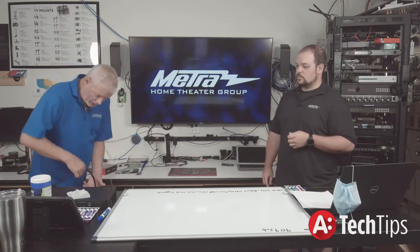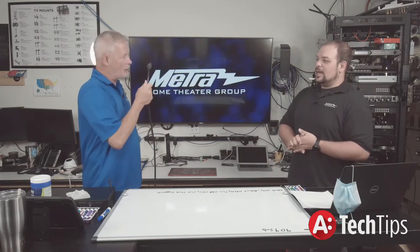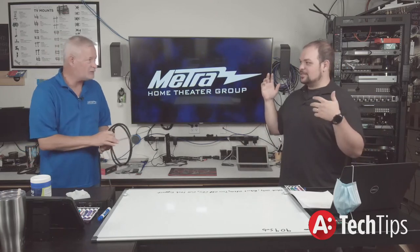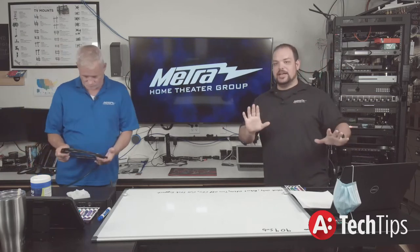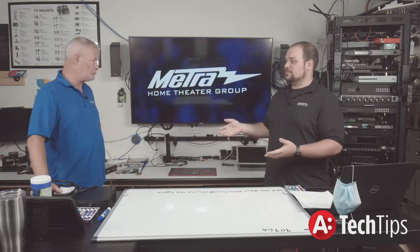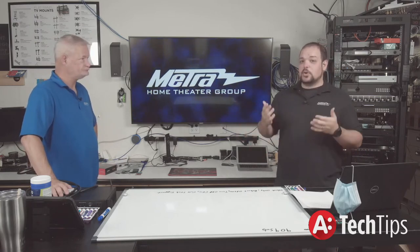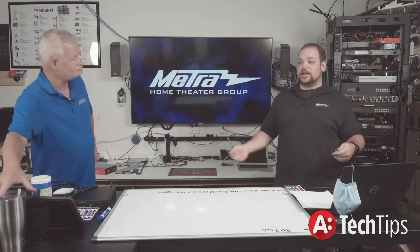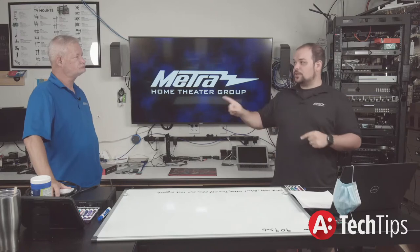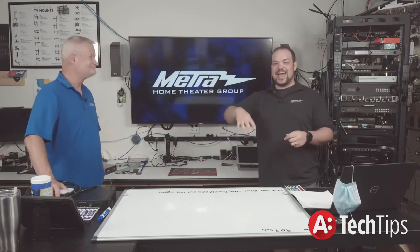Grounding is super critical, particularly on your power product. I legitimately cannot tell you how many times I've gone to a job site and seen the center leg pulled off a power circuit. Don't do that. Ground it whenever possible — that's very important. Ground things inside the rack to each other, ground the rack to the grounding pin on the plug. Make sure everything is connected to the same ground at the panel. Otherwise you might introduce noise. That also comes into play with HDMI problems, because HDMI is a wonderful ground conductor. When you have a TV further away and the rack is on a different plug, you get ground loops — the ground tries to dissipate across your HDMI connection, shorting out your HDMI plugs. You can burn stuff up. We've done that to our lab here at the shop.